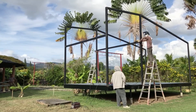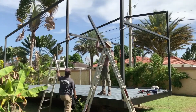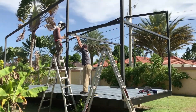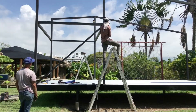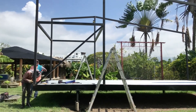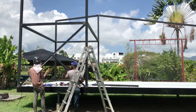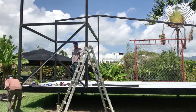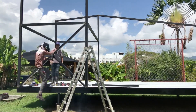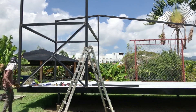Right now we're adding in the members supporting the lofted bedroom. You may be wondering why I'm not using much wood — here in the tropics, wood has really big termite problems, it can catch fire, and tornadoes tend to turn it into matches. It just doesn't seem like a building material of modern times, so I really prefer things that are more durable and less dangerous to live in. Here we're adding the X-brace that will add a whole lot of stiffness and rigidity to the house and the lofted bedroom. One thing to keep in mind: I just started a grass fire there from grinding or welding sparks, so it's always important to have fire extinguishers or water on hand.